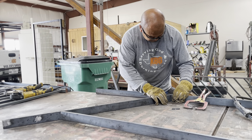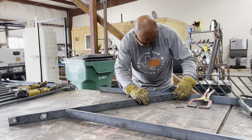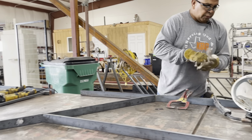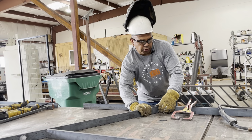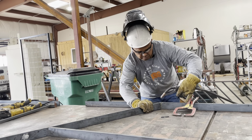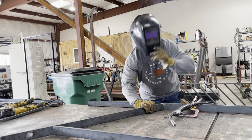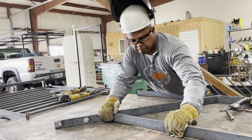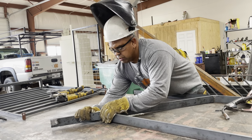That line's up there. So this one you can do the thumb test with your height. If you feel a flicker, then it's not flush. So this one, I feel a little flicker, so I need to raise this one up to get it flush. Line. This one needs to be raised.